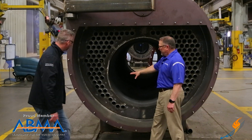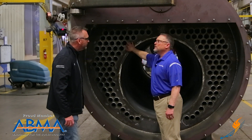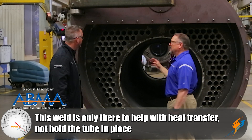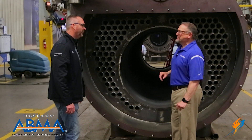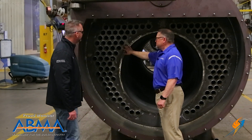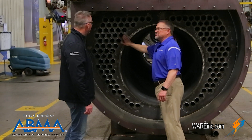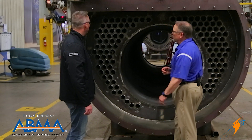On this product, at the inlet going into the second pass, we do a fillet weld on the tubes to help secure the heat transfer — that's really what that process is about. I don't like the terminology 'seal weld'; this is a fillet weld, a one-pass weld that helps the heat transfer from that tube sheet to the actual tube, and also protects against any flame length or flue gas erosion on the tube ends.